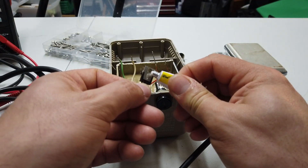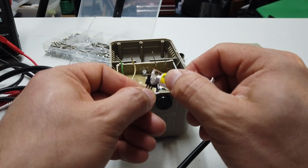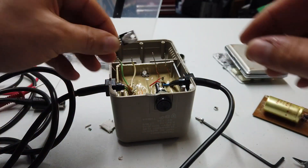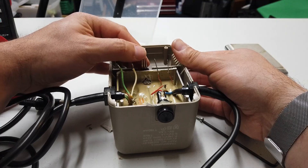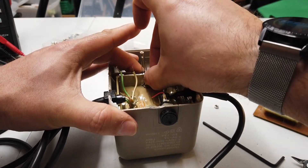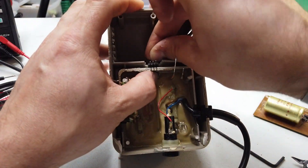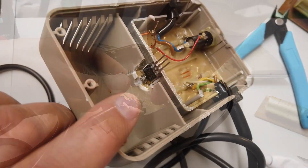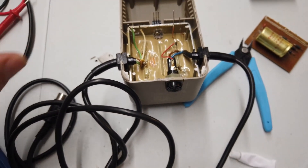Here's the mucky icky bit — we're going to put a little bit of heatsink paste on the back and smear it on good and proper, making sure there's plenty of surface area in contact. Then we're going to position it so it's in contact with the heatsink — that's the important thing. We'll pop the screw through one side and the nut on the other. And there we have it — one 7805 voltage regulator fitted into a Commodore VIC-20 power supply.